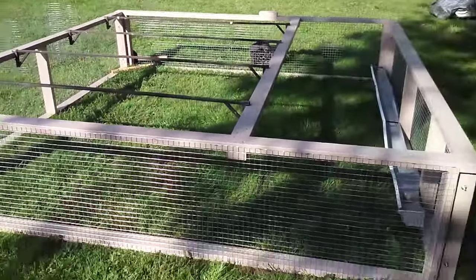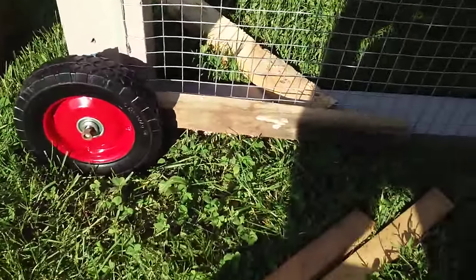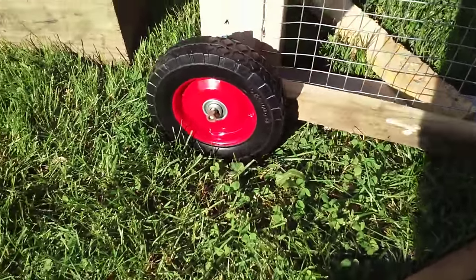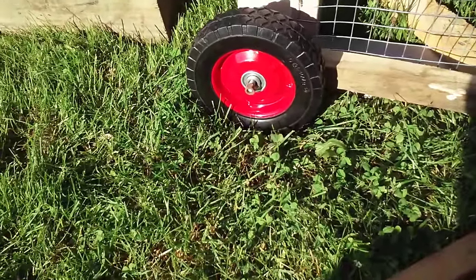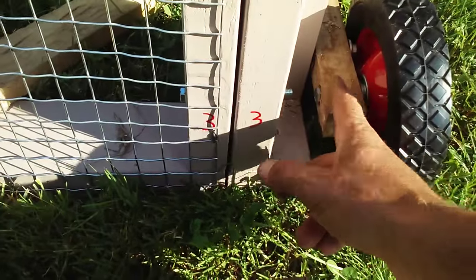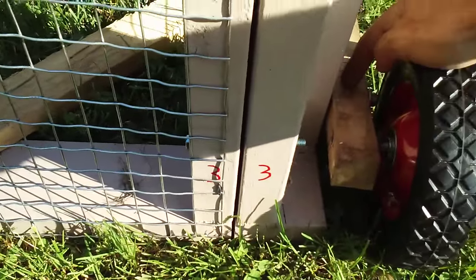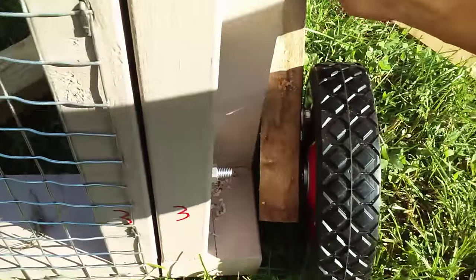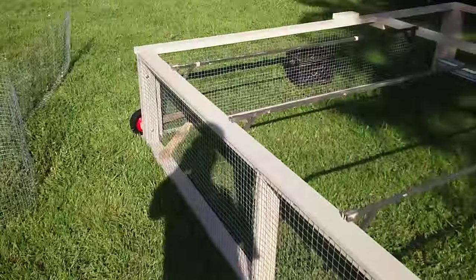As far as my wheels, a lot of people have resorted to using this new design where you use a lever which raises it — you can see it come up and drop back down. I need to get nuts for the wheels; that's why that one's not tight. From the back side, basically you've got a bolt that goes through the wheel, and then there's another bolt just a couple inches above that — a leg bolt that goes through into this two-by-four — which gives you this pivoting motion that raises it.